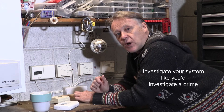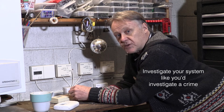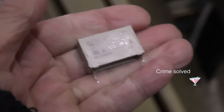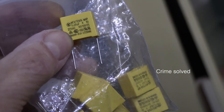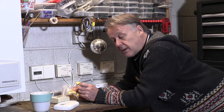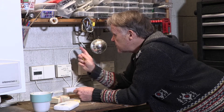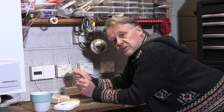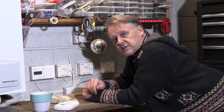Inside the radio receiver are some pretty simple electronics. What goes wrong in there costs about 10 pence — on the back of the circuit board there's a condenser. Just switch it out for a new one. I bought a pack of 10 because I'm switching them out pretty often. If you've got a soldering iron and you're handy: two screws underneath, switch it off at the mains, lift it off, clip the circuit board out and swap the old condenser for a new one. It's a 10 to 50p repair.